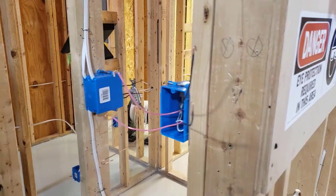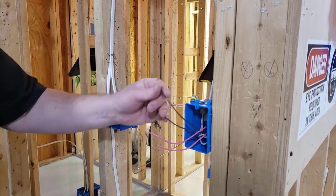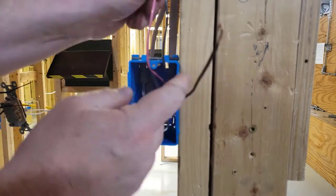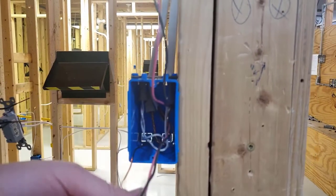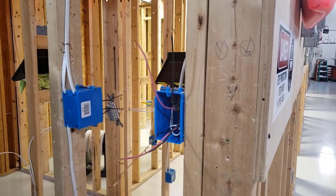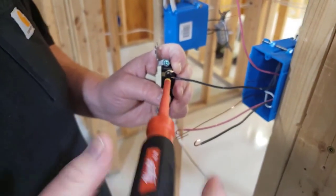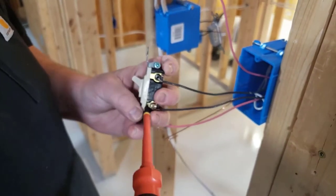What's really important now that I'm ready to install the switch: what if your wires get all mixed up and you're not sure what to do? Look inside the box and make sure your travelers are always going to be in one cable. I can see that this black wire and this red wire are in that cable, and this black wire and that red wire are in that cable. If I get this wrong the four-way is not going to work correctly. By the way, it doesn't matter which set of traveler wires go on the input or the output — it's totally interchangeable.